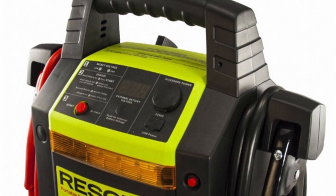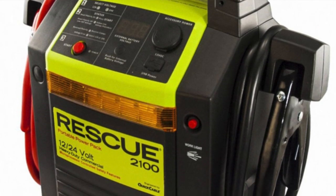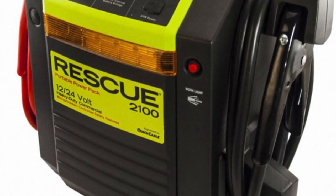So what is a portable power station? I first saw these things hit the market when I was a kid. They were lead-acid little portable stations — usually had a flashlight and some jumper cables, a 12-volt cigarette lighter socket. At first they didn't have 110 outlets, but over time they started putting inverters on them. Most everything when they first came out were modified sine wave. My first portable power station was made by Goal Zero, bought in 2012, and it did not work worth a lick. I think it was a nickel-cadmium battery. The industry has come a long way since then.